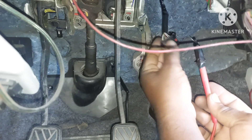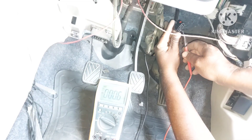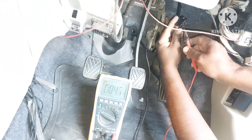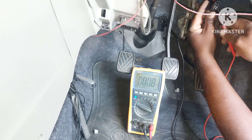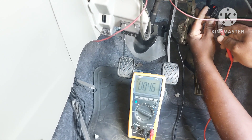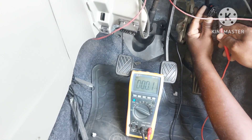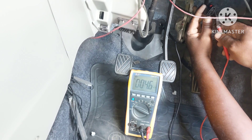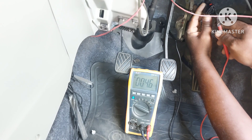The second wire is blue. Moving through the pins: second pin reads 4.7 millivolts, third pin reads 4.6 millivolts, fifth pin reads 5 volts, sixth pin reads 4.6 millivolts, seventh pin reads 4.6 millivolts.